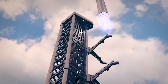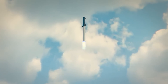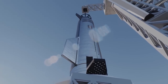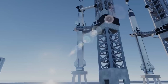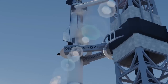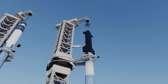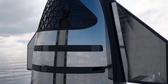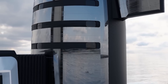SpaceX's upgraded design seeks to simplify that process, mainly by increasing the size of the gores. Aside from modestly reducing the number of longitudinal sections needed to form the cone, SpaceX has already reduced the number of stacked sections from five to two, slashing the total number of gores needed by at least a factor of two or three. While not quite as substantial, the same simplifications also reduce the length of circumferential welds needed to assemble a cone.